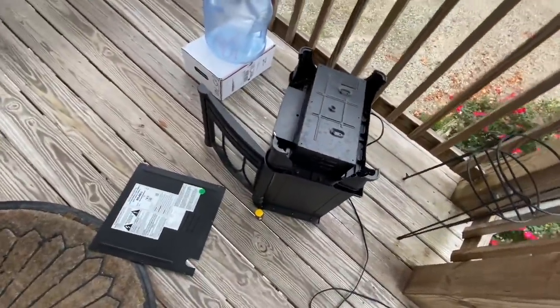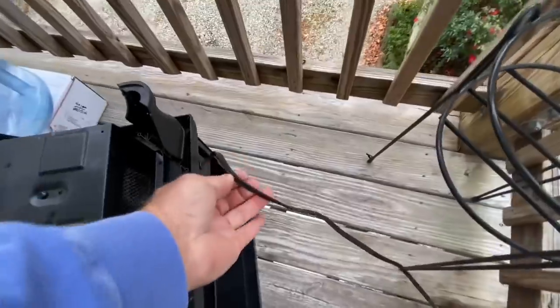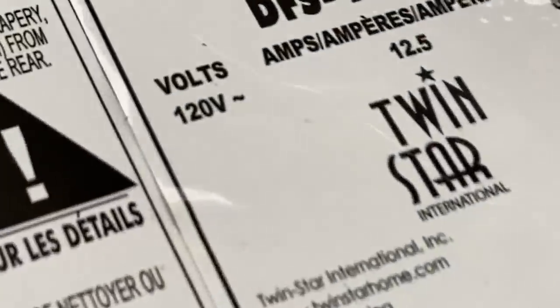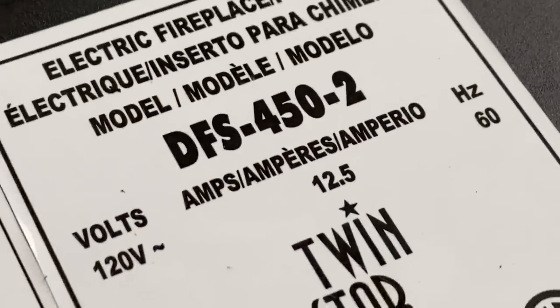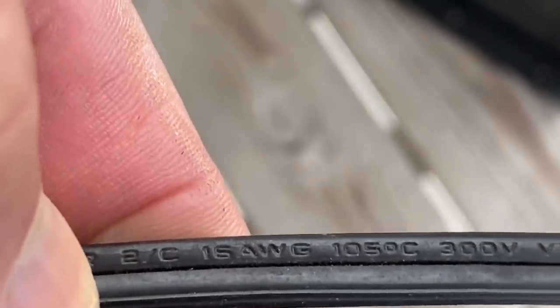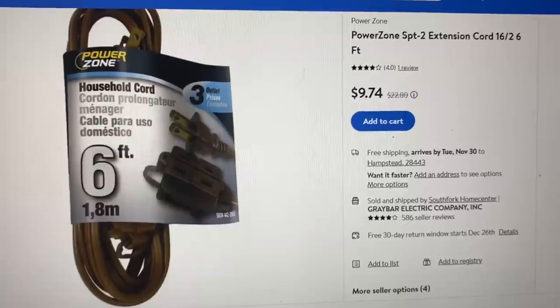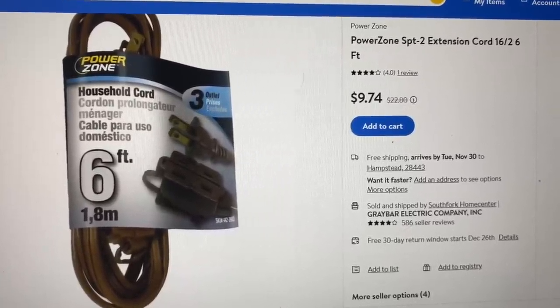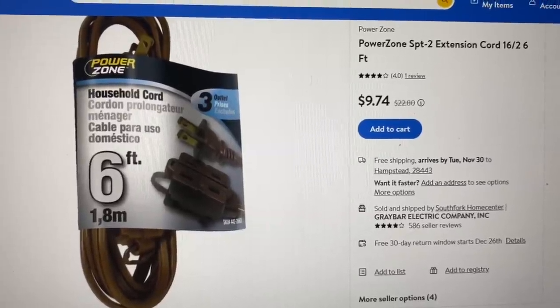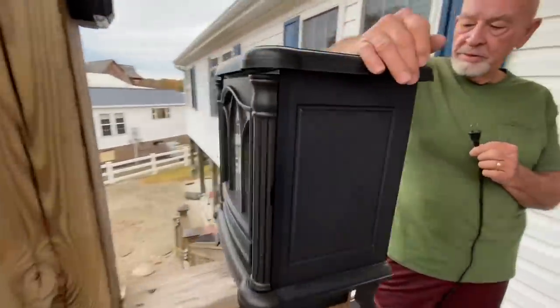I just don't trust this piece of equipment - it seems very dangerous. Now we know - the amperage is 12.5 amps. I don't think this cord is heavy enough for that. I looked it up and this should be 12 or 14 gauge for that amperage, but this one is 16 gauge. This extension cord here is 16 gauge, a two-wire cord - and as a reminder, you never want to use a lightweight household cord like this for something that draws a lot of amps. It's just very dangerous. Thank you Dennis, and thanks for watching everyone - be safe.